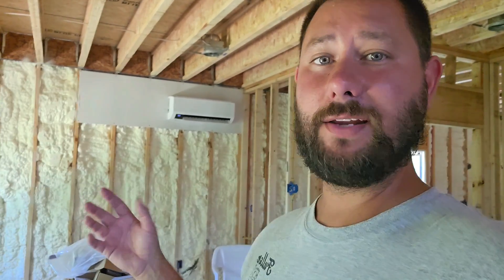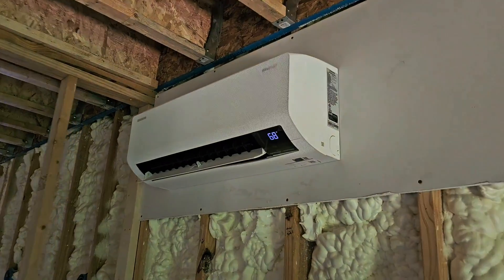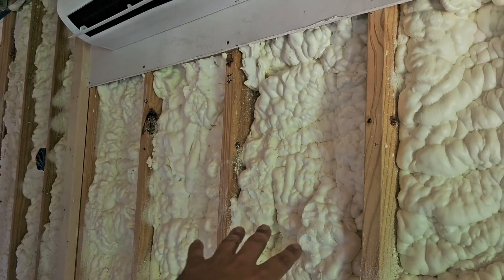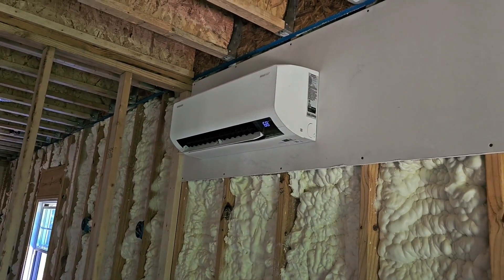This is a very easy option, but you have to make sure that you have some plastic and tape so you can cover up this indoor wall mount air handler so that it doesn't get damaged or dirty during the build process. This is the plastic and tape that was used to cover up the wall mount air handler before the foam insulation was installed, so you don't have a bunch of foam insulation on that unit.